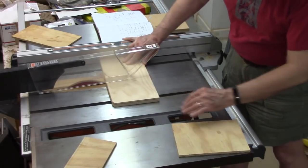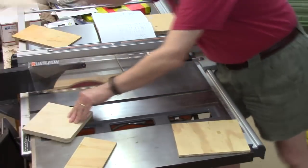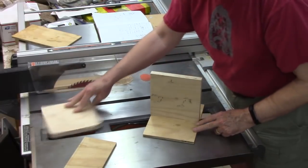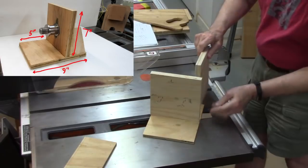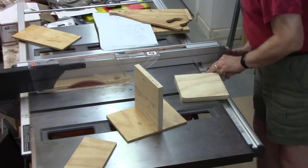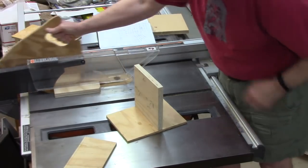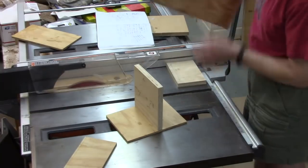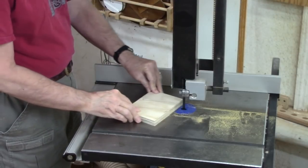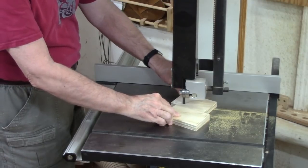It's already seven inches wide so I just cut it seven inches tall, then fit it on the base about five inches back from the front. I grabbed another scrap and cut a couple of gussets — one for each side — about three inches wide at the bottom and not quite as tall as the upright. I took them over to the bandsaw to cut the diagonals, using one as a movable fence to support the other — a pretty good bandsaw trick that keeps your fingers away.